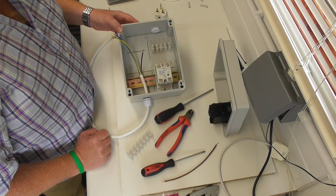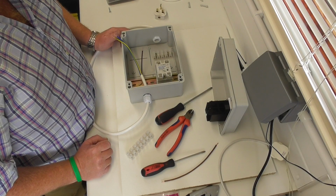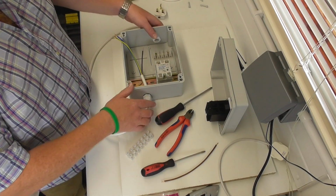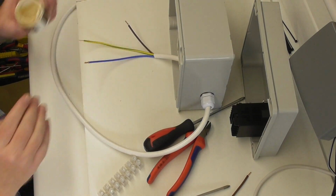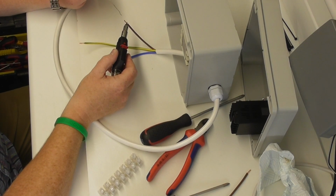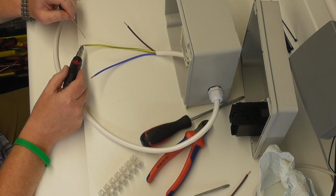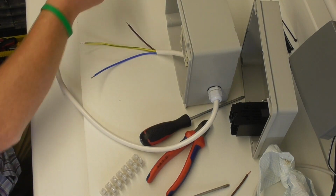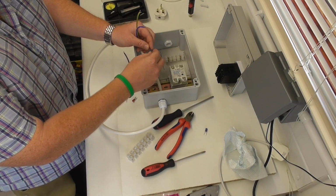So first job, get that onto the contactor. And then obviously I'm going to piggyback that over also onto the controller, onto the PID. But firstly, OTT, I know, but I'm just going to tin the end of these with my soldering iron and, well, because I can. Why not? Let's get this show on the road. So, job one. Let's put a crimp on the end of hither.